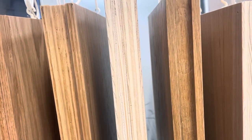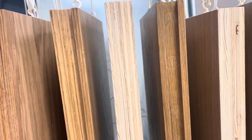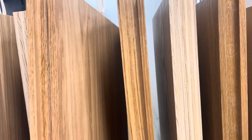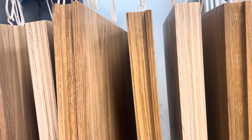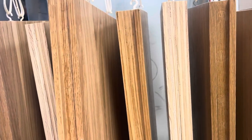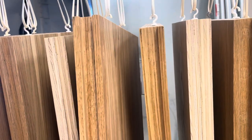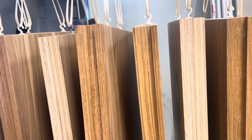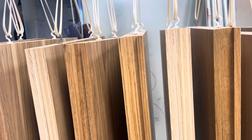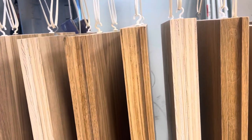But prep work is the biggest thing, so we used a sanding sealer — a penetrating sealer. Guards is what we used to first put on here. I just found that Guards actually penetrates a little bit better. It's made for problem surface areas, but I'm finding it works very well for raw wood. It really penetrates into that wood because it has a thinner viscosity than water, so it penetrates a lot more.